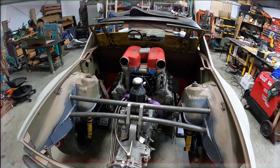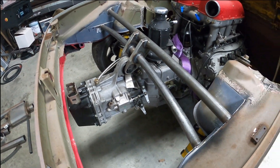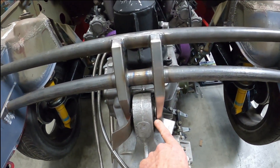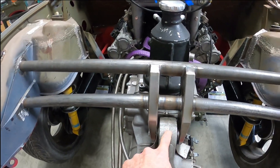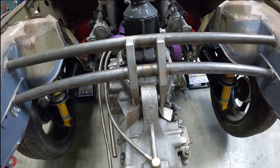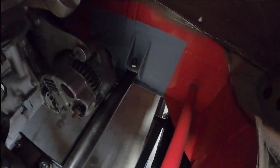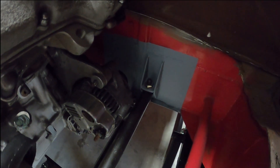It's stuffed back in the car with the drivetrain and we finally get to see how we did. It turned out like this — it's epic, it's so cool. Those little handles are welded onto some washers to help shim this thing over. Interestingly, you can see it's still not centered, and the reason is the mount itself isn't centered inside the transmission housing — so when I replace this mount it'll get literally squared away and be dead center. The hanger mounts are absolutely lovely and beautiful. The firewall tabs with the fasteners — those aren't the final fasteners. They're going to be done with a flathead on the bottom to keep ground clearance issues at a minimum, and then a regular bolt going up through the outside one.